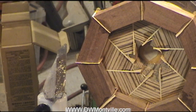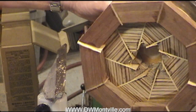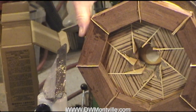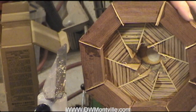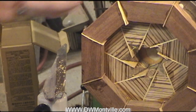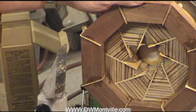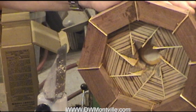Now that it's all set and glued and ready to turn — it's been a couple days — I wanted to demonstrate how my tool works in turning a piece like this. You can see I've left the corners on here; it was just too difficult to try and shave that off with the band saw. So I'm going to turn them off and make this square first, then show you how this tool handles a very bad interrupted cut with all the raw edges hanging out.